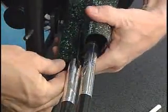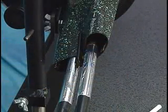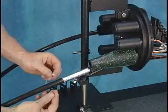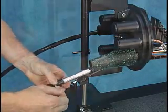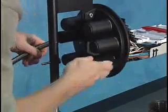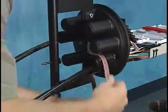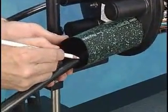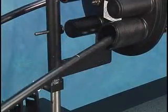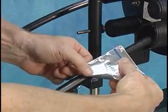This is accomplished by using either a branch-off clip or a wraparound adhesive and metal pad we call SCOP. When a feed-through cable is used, we recommend sealing that cable into the oval port first. Clean and abrade the oval port and the cable sheath within 3 inches of the port. Pre-position the port seal on the cable and mark its position for easy locating on the aluminum tape. Aligning the mark on the aluminum tape with that on the cable, wrap the tape around the cable as instructed.